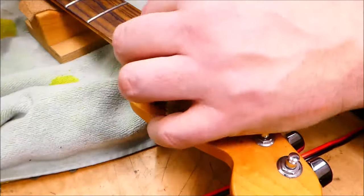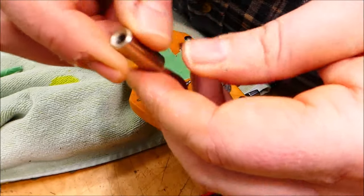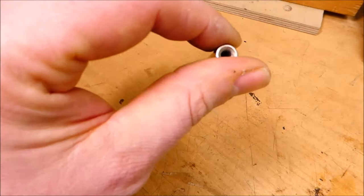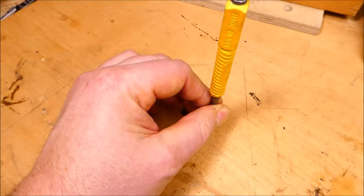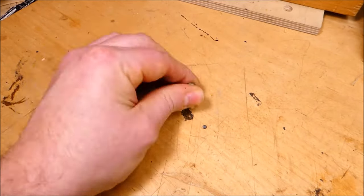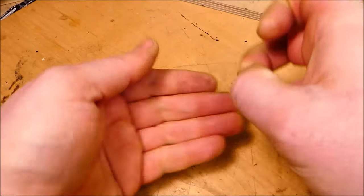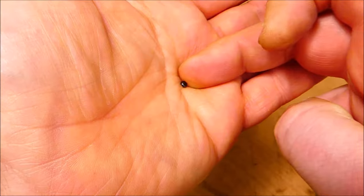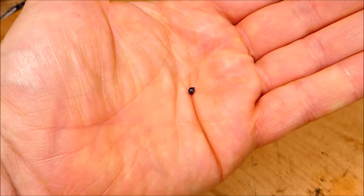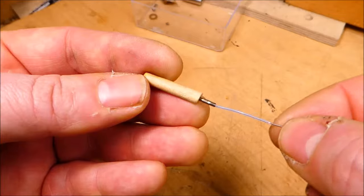Eventually the nut reaches the end of the rod and there's no more force against the plug, so I resort to pliers to extract it. This could be reused, but I think I'll go ahead and put in a fresh one. And here we get a look at the nut itself — you can see it's nearly the same diameter as the plug. There's no way to extract that with the plug in place; it's just too large. Ordinarily this would be a tunnel — you can see right through it — but it's definitely blocked up. Yeah, I think this is the ball end, or the tip of a ball end Allen key. And there's your problem. This thing did very well for itself — you can see it didn't burn up; it's probably good for another use.